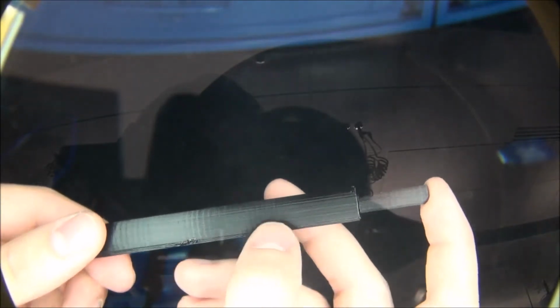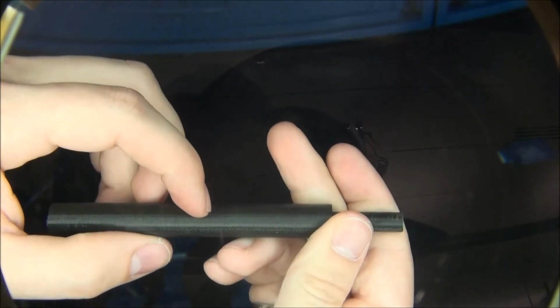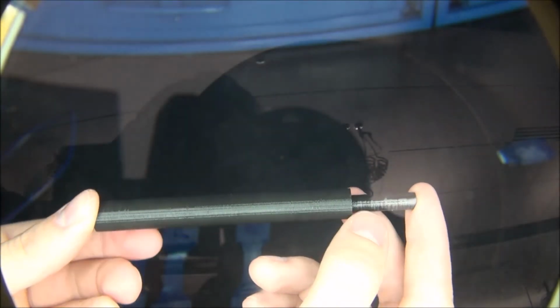I'll first start with this one. You can see the layers being like that, so when you try to torque it, if you're taking DME, this will make more sense, this resists torsion and it resists bending because of the way it's printed. It's easier to see how this one fails at that, because the layer-to-layer bonds are the only thing keeping this from snapping when I bend it. When I'm doing torsion, the highest stress for torsion is on the surface there, and it wants to move the two layers apart with respect to each other. And that's only 2,000 psi that we've tested on that.